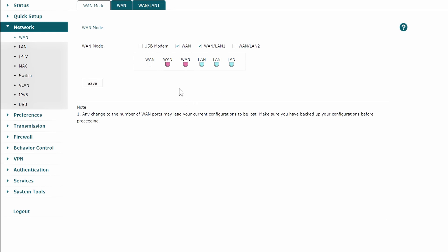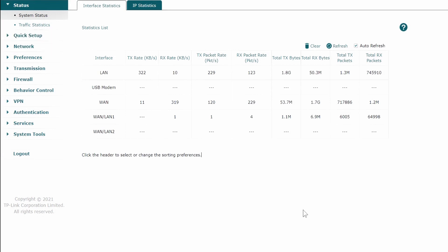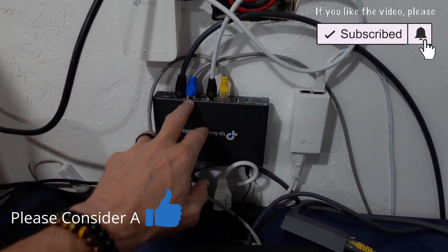I'm going to do a quick test. Let's go to Status then Traffic to see if the setup is working. We can see Starlink has received 1.7 gigabytes of data whereas AT&T U-verse only 7 megs. We know this is working because the lion's share is going into WAN 1 which is Starlink. But there is data on AT&T, meaning every once in a while there is an outage where the router fails over and then comes back. We have WAN 1, WAN 2, and even a possibility of 3 WANs on this unit.